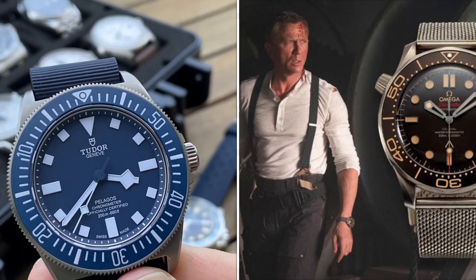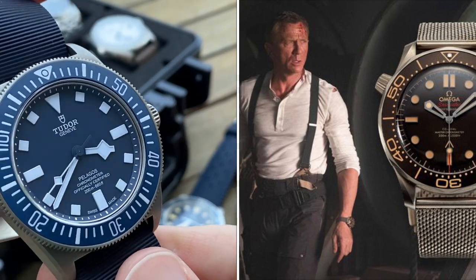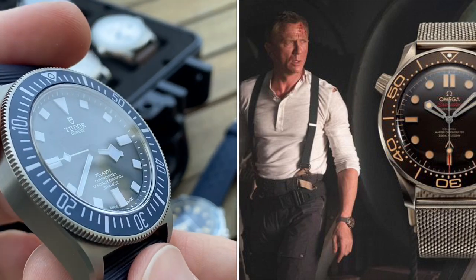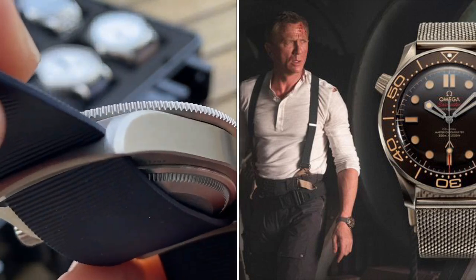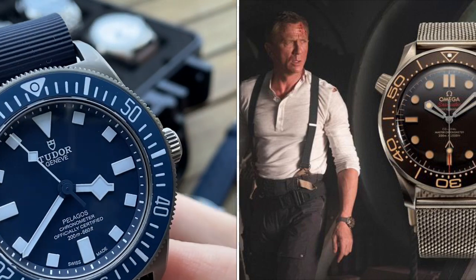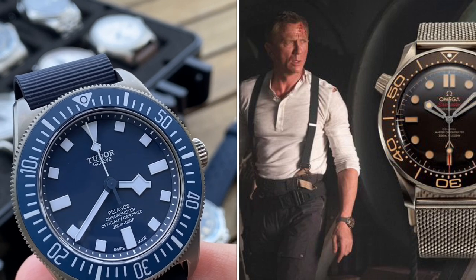The problem with titanium comes from the property I was mentioning, is the fact that it doesn't absorb heat as much. So when you work on it with a Dremel or anything else, or to carve it out, what would happen is the heat does not dissipate in the case itself; it would dissipate on the tool. Okay. So the tool. You need to change it. So you need more special tool, and it breaks more often.